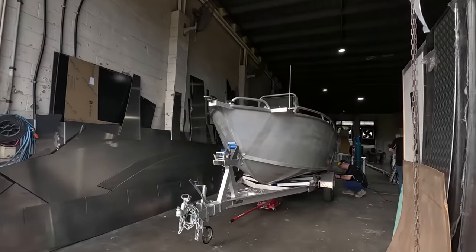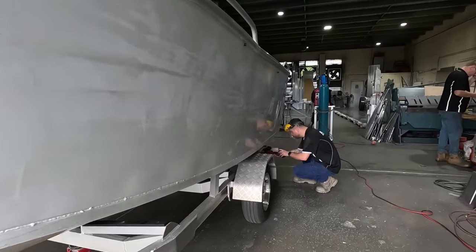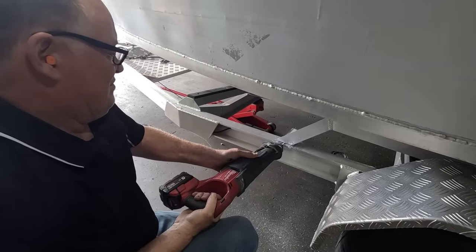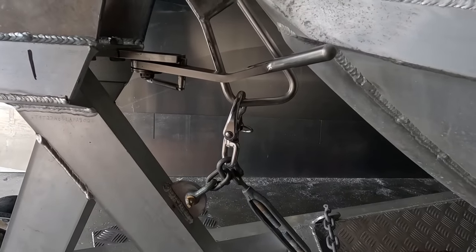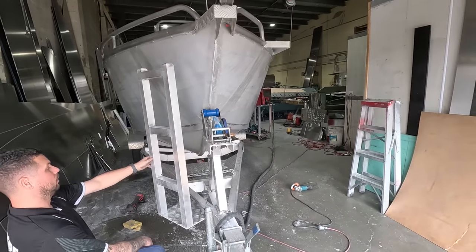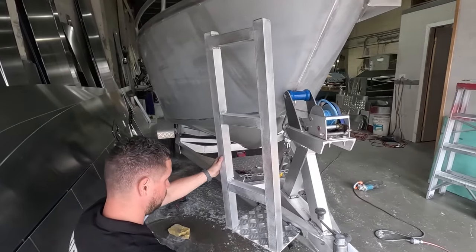would modify my current Riptide trailer to suit this boat and begin the long list of additions and modifications to transform this boat. The trailer skids were cut off and new ones lengthened to suit the deeper V of this hull. The winch post was also removed, shortened, and we fitted a boat catch for easy launching and retrieving when fishing solo. This also meant a ladder was required so I could get on and off the boat, so Stu quickly made one up to suit the limited space we had.